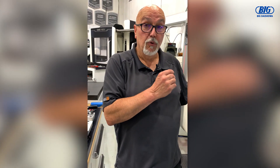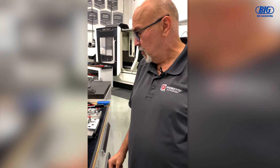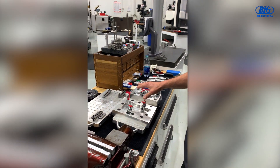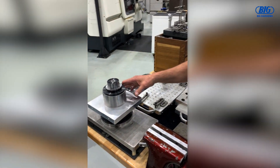These pallets will repeat within two-tenths of a thousandth of an inch — I've checked that, and it's been actually even closer than that. So a lot of these pallets that I take care of have to do with either fixtures or the grid, or obviously the vise in the machine.